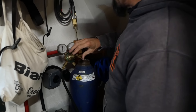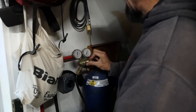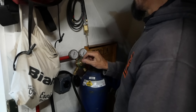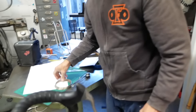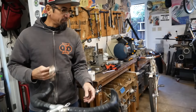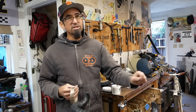Generally it's two to one - so if you have acetylene at five, you have the oxygen pressure at ten. That has worked for me. On this part it's a really tight joint so I'm going to use 56 silver - it's going to flow thinner. It's not going to build up, and in this case we don't need it to build up; we just need it to penetrate.